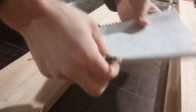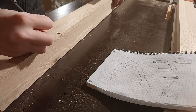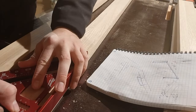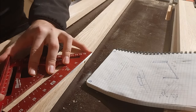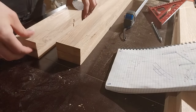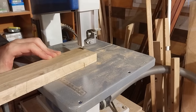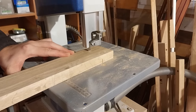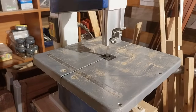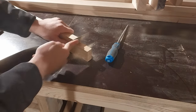Some of the narrow boards will be turned into legs. Since they come from a table, there were some screw holes in them. So I inspected the boards and marked which side went towards the wall by writing 'wall' on them. I also removed some material at the bottom of the legs so they could go all the way to the wall without interfering with the baseboards. After removing most of the material on the bandsaw, I used a file to finalize the shape of each leg.